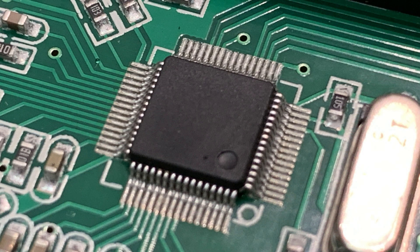There's another chip here — I thought it might be the LCD driver, but probably not. I'm not sure what this chip is; it wasn't marked and it was on the main board. It might be the DVM — actually, now that I think about it, it's probably the DVM on a chip. Here's the actual chip that does most of the DVM work, and the oscilloscope goes in through a different channel — it goes into that A-to-D converter.